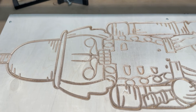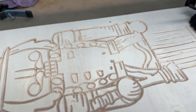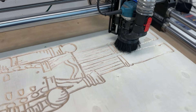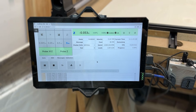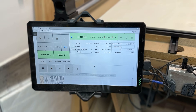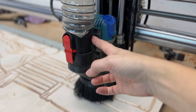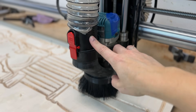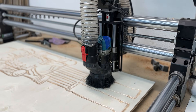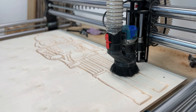If you're not familiar with EMI, that's electromagnetic interference. The two main ways you might have issues with it are having too many things plugged into the same circuit, and/or improper grounding. Every time I would go to adjust or touch the machine during a job, I would get a little static electrical shock — just a little zap — and that told me something wasn't quite right.